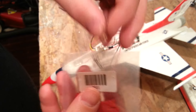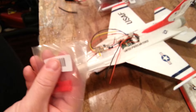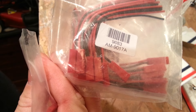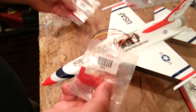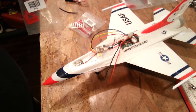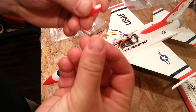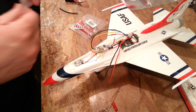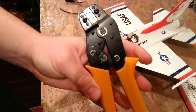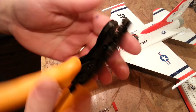What we just got done is connecting this, so now we're going to go ahead and get a JST mounted so that we can adapt to the battery. Part number 9631 gives you just the pins and the connector itself for the JST end. You can also, if you prefer not to build those and buy the building tool, just buy this part number and splice them on with heat shrink and soldering.